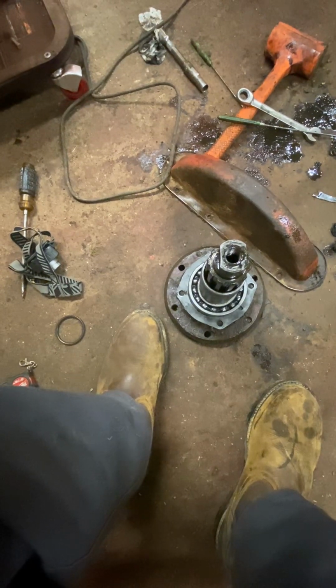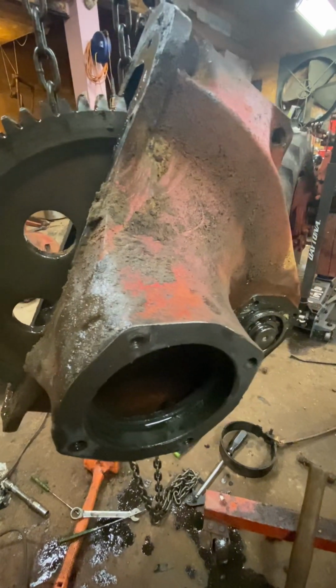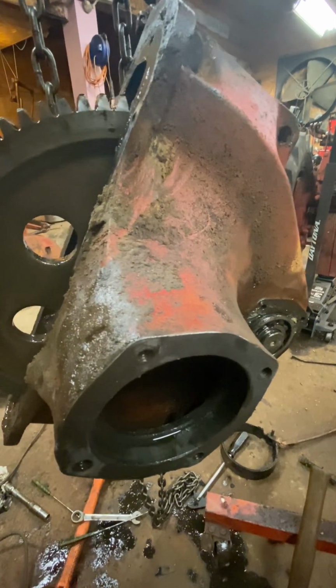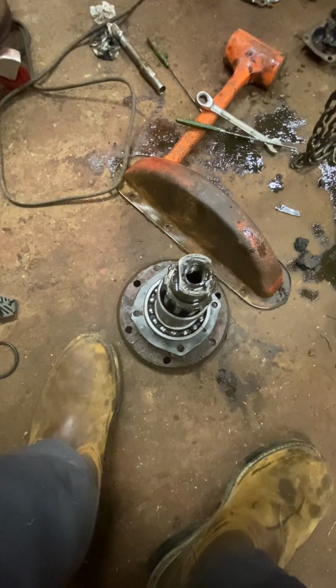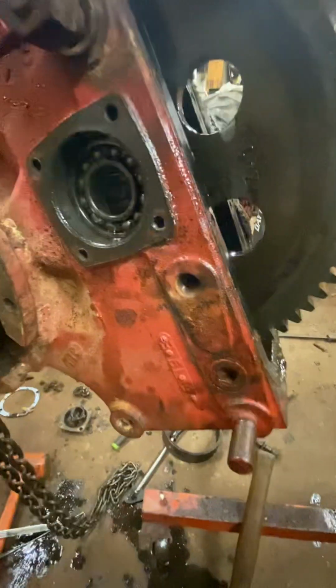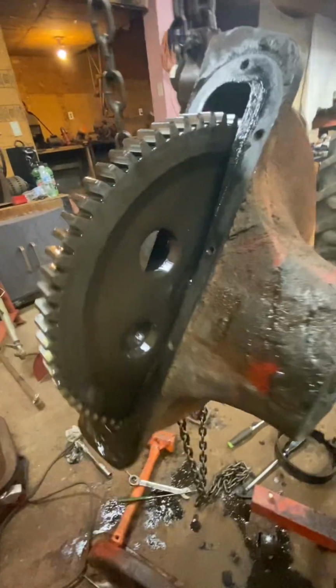But that's your side to side rocking that the old folks be talking about, shaking them all the time. I said, if I had bad bearings or anything, whatever this rocking is, when I pulled on that axle as soon as I got the tire off, it went clunk, clunk, clunk. I said, yep, I got a bad bearing. That's not a bad bearing. It's just that bushing worn down. I doubt you'll be able to buy that part. But anyway, the side to side play is rocking in and out on the axle because you're not tightening up race to race on your bull gear. Your bull gear is just sliding back and forth. You ain't got it locked together tight. Well, we're going to get it all locked down and see what happens.